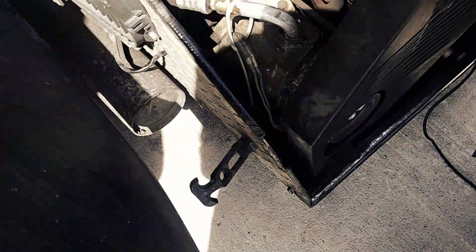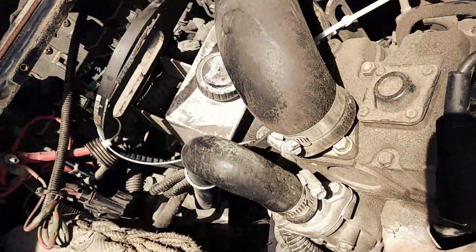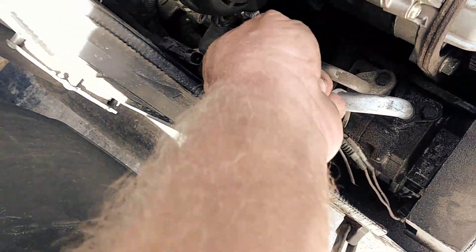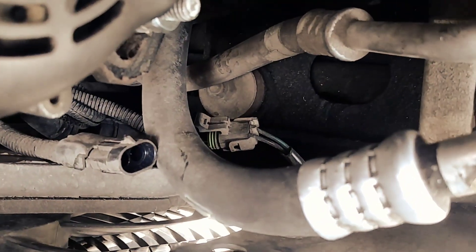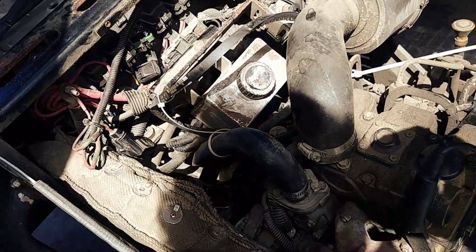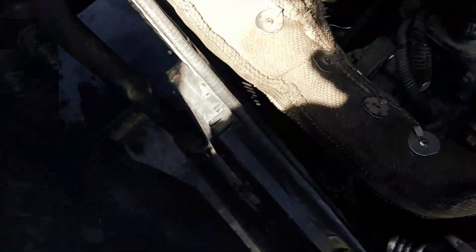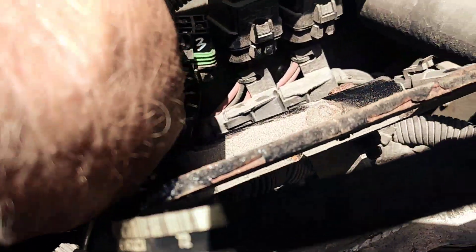So what I did is, before I started it, I disconnected this wire — see down through here, there it is. I disconnected that to check if power was coming out of this connector, and it was not, even with the unit running. So I called our tech guys in Springfield, Missouri, and they told me it's controlled by a relay — the third one up here, one, two, three from the left.